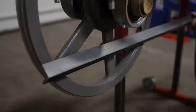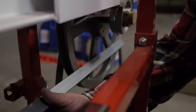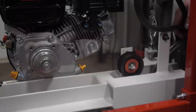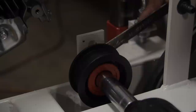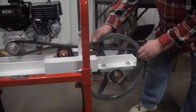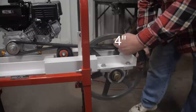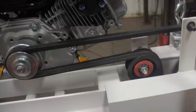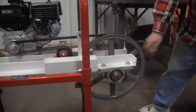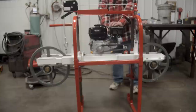Band wheel alignment: once the drive wheel is aligned with the clutch, align operator side A with drive side B wheel. Both wheels must be flush on the straight edge. Install drive belt around the clutch and over idler pulley. Take belt about 2/3rds around the band wheel, leaving the top 1/3rd off — do not install around the band wheel at this time. Measurement from the top of the drive belt to the top of the band wheel should be approximately 4 inches. Adjust the drive belt idler pulley for this measurement. Once adjusted, roll belt on while turning the band wheel. Deflection should be no more than a half inch with 5 pounds. Start engine and run to check for belt alignment.